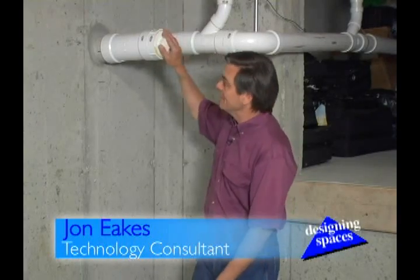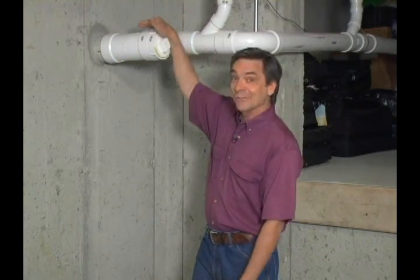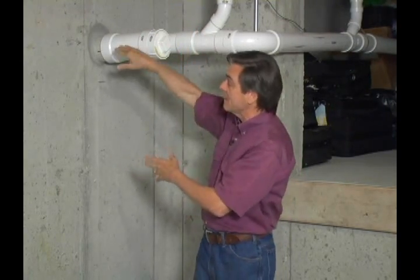The homeowners had a simple request in this house. They wanted to put a bathroom down in the basement. Take a look at this pipe. This is the sewage drain. So if you need a gravity flow from the toilet outside to the sewage, well, there's no room here at all possible. In some basements, the same pipe is down lower, but still, you have to build a throne. So it becomes a problem.